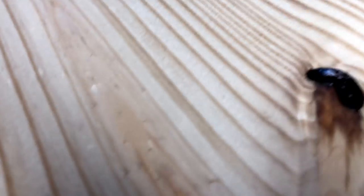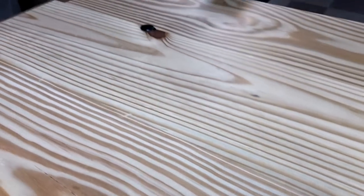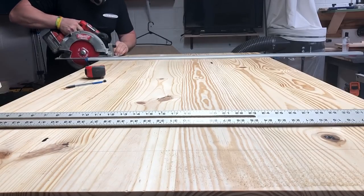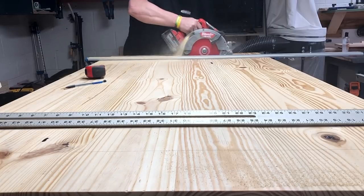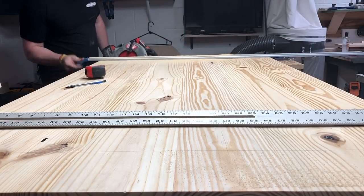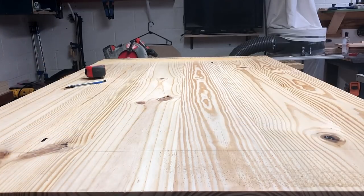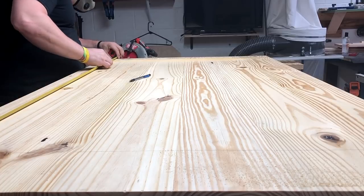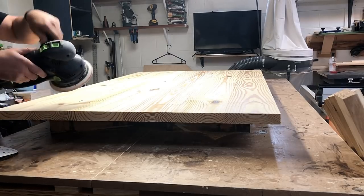You can see what I'm talking about, and in another video I'll show you a gigantic void that I filled with it — it actually looks almost like an epoxy pour, and I think it looks awesome. Now if I was doing something like a river table, obviously I would use epoxy and not this, but this works for exactly what I wanted it for. I have used in the past wood filler, and glue and sawdust, and all those are fine, but they just do not work as good and don't look as good. Wood filler is kind of weak — I use that for painted stuff to fill knots that are going to be painted, but if you use it on a stained surface, it's kind of soft to the touch even after it's fully cured.